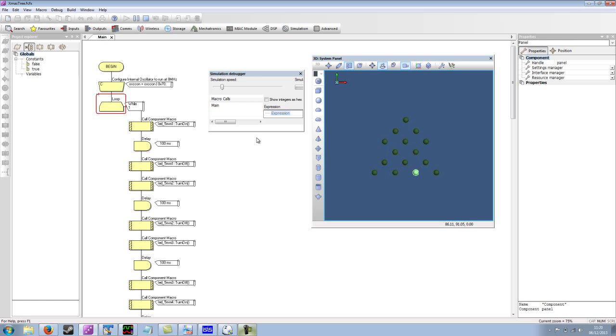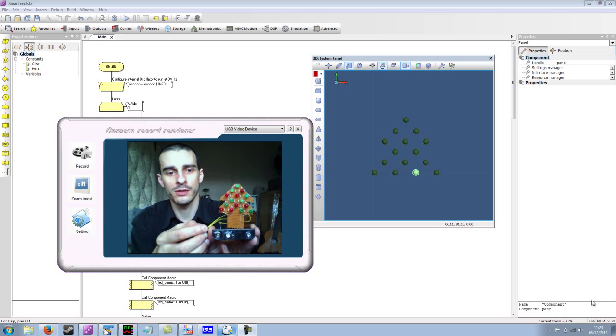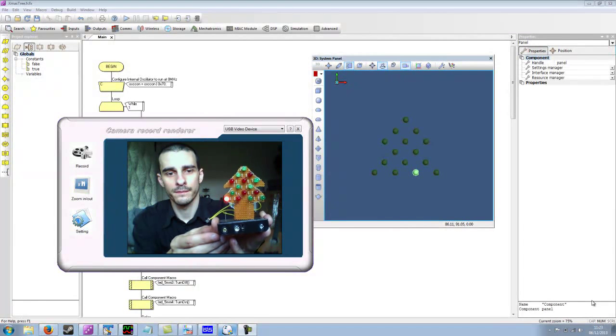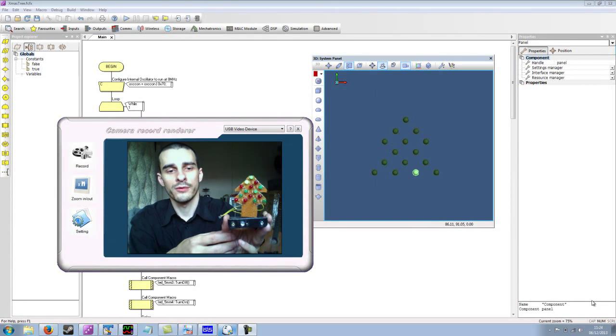Now, if I put this on the hardware and one of the LEDs fails to light, then I can use a multimeter to check the connectivity between the LED, the resistor, and the microcontroller pin. If two of the LEDs come on at once, then I know there's probably a short somewhere in the circuit. And again, I can use the multimeter to try and check for any shorts on our veroboard. This running on the hardware can be seen as such. So each of the LEDs we can see is lighting on its own, and this way we know that the signals to the LEDs are all correct before we start creating any effects to go on the LEDs.